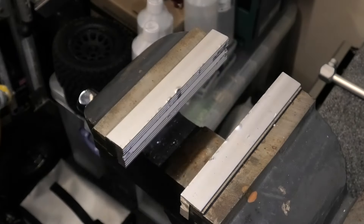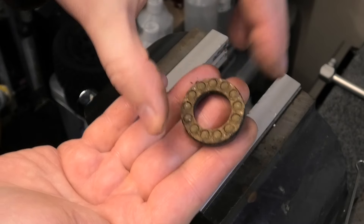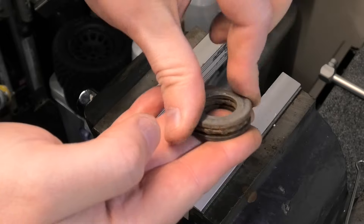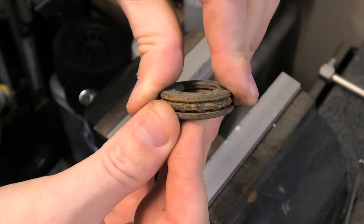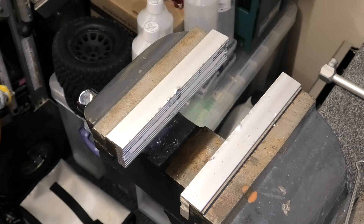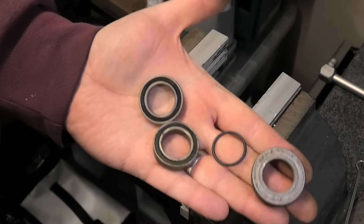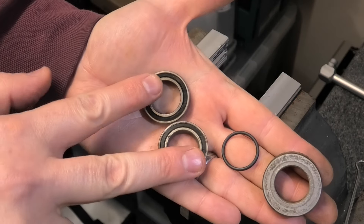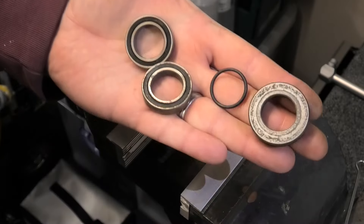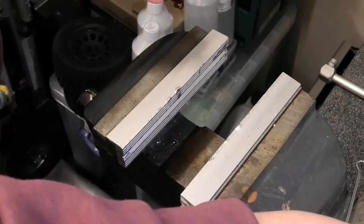So there are two of those bearings and one axial thrust bearing in the whole assembly. Normally on these, the part number will be stamped on the outside edge — you can see the three pieces going together, but it's just nasty. In the case of that axial thrust bearing, because it was so corroded and rusty, you couldn't see the actual bearing number. So let's run through some of the bearings and o-rings. That main bearing — you have two of them in the kit alongside the o-ring — is what you would get in the bearing rebuild kit that costs you £75: two main bearings, one thrust axial bearing, and one or possibly two o-rings. Even so, £75 is extortionate money.